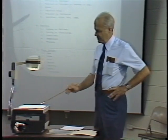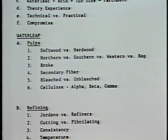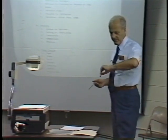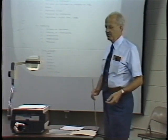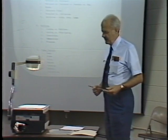In addition to primary pulps, we use some broke and at times secondary fiber. Secondary fiber is not preferred because it doesn't receive the acid as well as virgin fiber — it's much better to use virgin fiber. We use both bleached and unbleached pulp, and both seem to parchmentize equally well. There doesn't seem to be any interference in the parchmentizing effect from the color on the unbleached pulp.